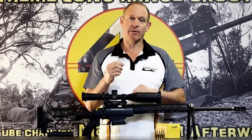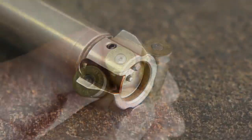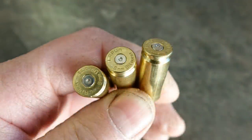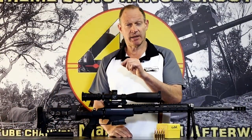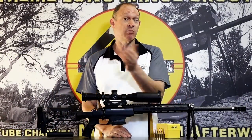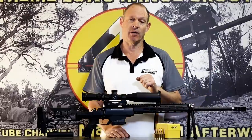So I made that nice and round with a flat top, got it to 55 thou, put it back in, and tested it. All fixed, no problems whatsoever. I'm going to truck along with that for good from this point forward. So that was the problem, but the different primer that people suggested would have fixed it as well. Probably running a little less powder in there would have fixed it as well.